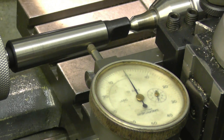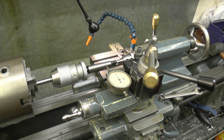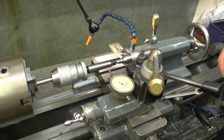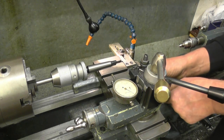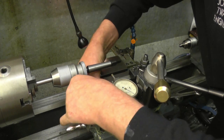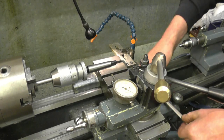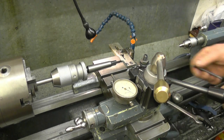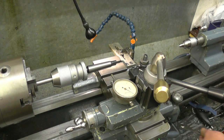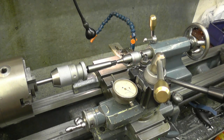There are no graduations on the compound slide of mine, so that's without using a protractor at all. What I'll do is nip up the bolts that lock the compound slide and then we'll check it all again. Just nip them both up evenly — this one's a little bit more awkward to get into. We'll just use a ring spanner. You don't have to go mad but it's got to be snugged up. Then we'll check it again.